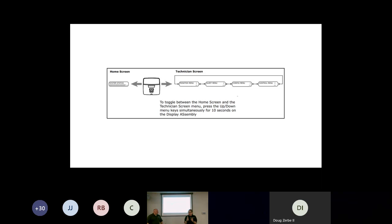Okay. And the next question is, okay, so then air conditioning, yes. Is it single stage or 2-stage? Now, it doesn't actually ask you that question, but what it says is ODU, outdoor unit, is it a 1-1, which means single stage, 1 compressor? Is it a 2-1, 2-stage single compressor, or a 2-2, meaning 2-stage, 2 compressor unit, which is for a retrofit of our old 2-stage unit.